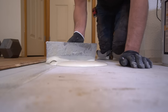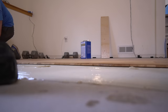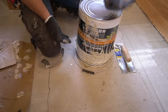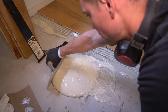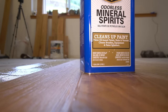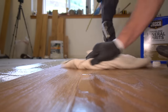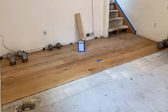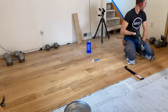As you work into larger more continuous spaces, I suggest pouring out a large amount of glue onto the surface and spreading it with your v-notch trowel. Once you get to the tail end of your bucket, flip it over onto its end, let it rest for 10 minutes, and you come back to a large pool of glue that would have taken effort to scrape out yourself — let gravity work for you. With all this glue comes the fact that you will get some on the floor no matter how hard you try. The best product I've found to remove it is mineral spirits and a clean cloth — as long as the glue is still wet it's extremely easy to remove, and even dried glue can be fully removed with mineral spirits, it just might need a little extra rubbing.